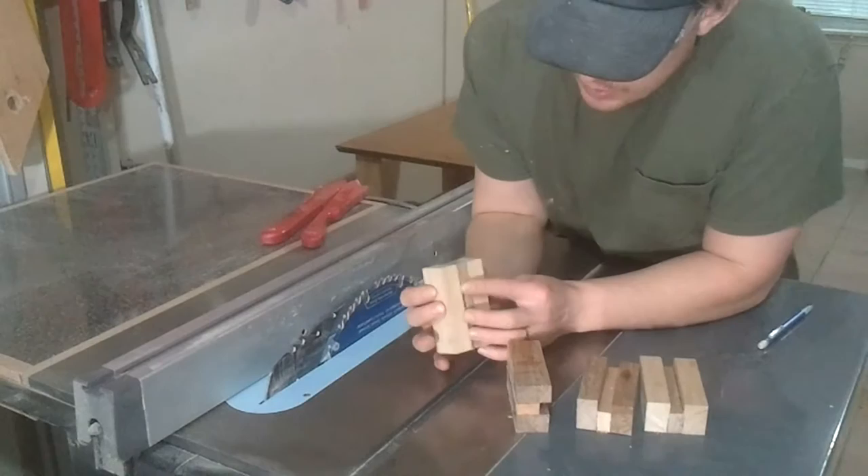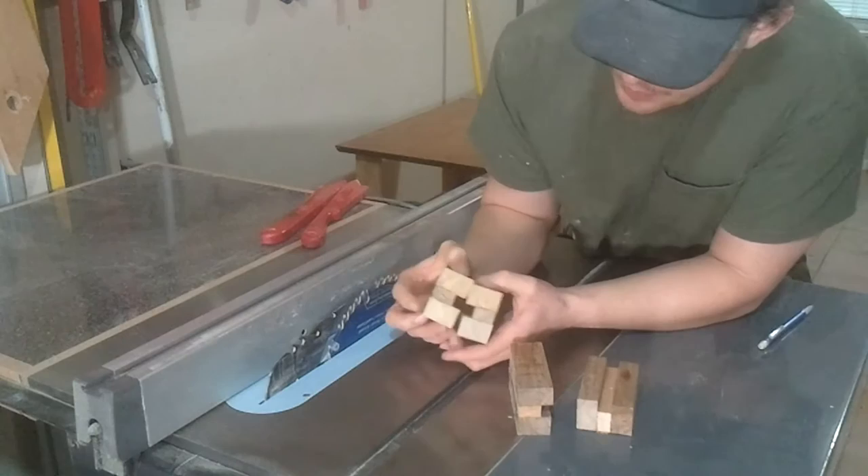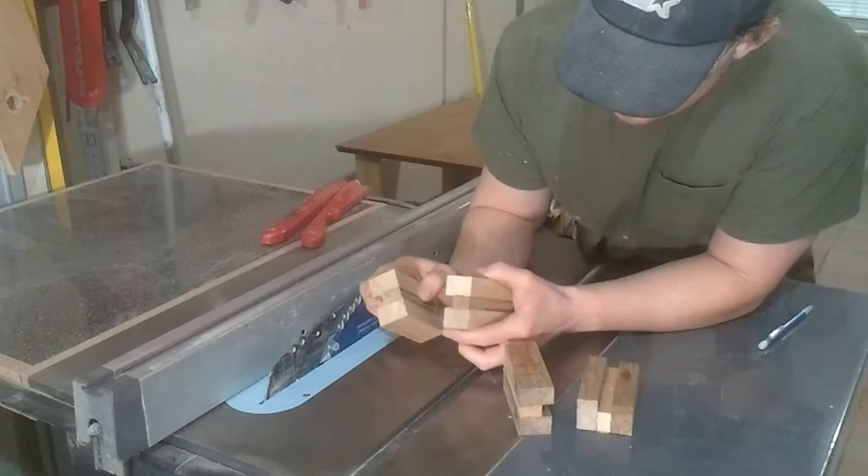It's going to have to sit for a little while, so I'll get this clamped up and do something else in the meantime. All right, I've got my blocks out of the clamps for the initial glue-up. Just like last time, I glued up a veneer strip in the middle — this time it's a little bit thicker. I've got a half-inch strip in the middle and the overall body is about two and a quarter, so it's about three-eighths of an inch wider than the last batch. I still have to trim it down.